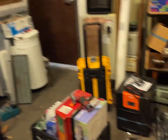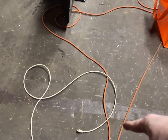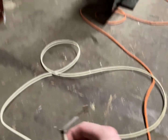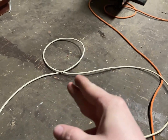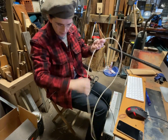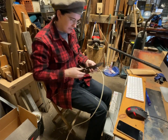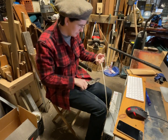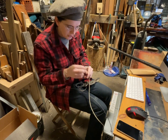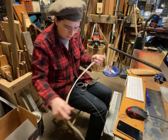We need a wire — I have a piece of solid core copper wire which should work fine — and this coaxial cable which I've already used as an antenna once before and soldered to. We don't need as much cable so I'll snip it. The TV is positioned so the antenna will sit right above it. Unfortunately this is a pretty cheap coaxial cable — it's so cheap that if you try to pull out the wire, there's nothing really holding it together.